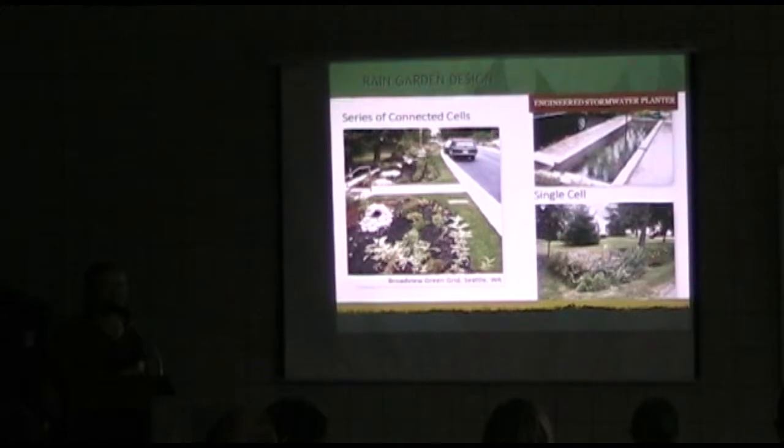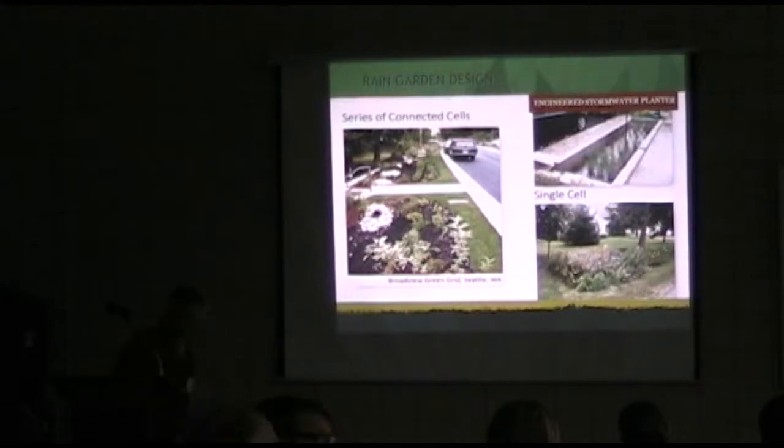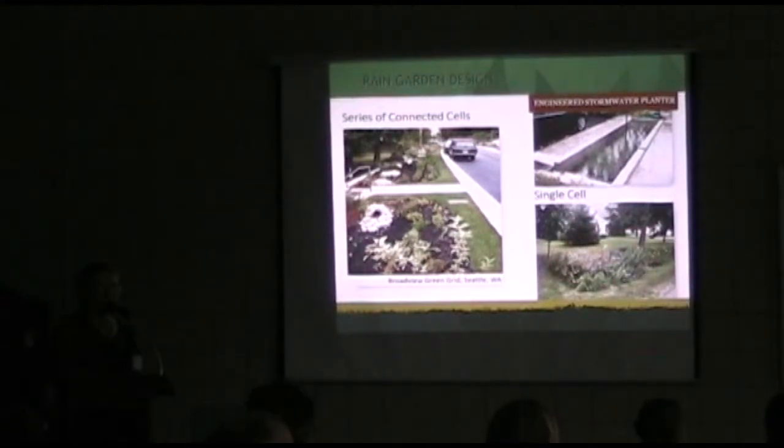With warming and the growth zones becoming ever warmer, and mosquitoes, yellow fever, malaria, etc., becoming a concern, are people expressing any concern about having these basically stock ponds growing mosquito larvae? Well, the rain gardens should not hold water for that length of time. So they're faster draining. That's part of what you're doing when you're draining for soil mix. We're ensuring that the water level is not going to stay above ground. It's going to sink down below grade, and that will keep mosquitoes from hatching in it.